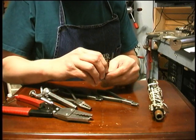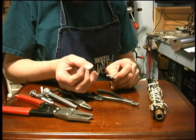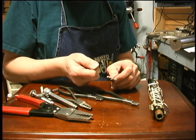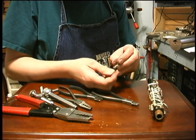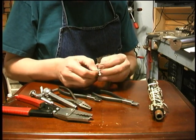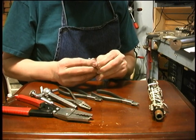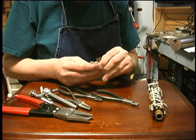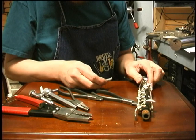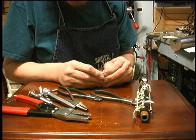The first thing that happens when you swedge is the hinge tubing will go down to the size of the rod. And beyond that point, the metal has to go somewhere as you continue to squeeze, so the tubing will stretch out lengthwise and fit more snugly between the posts. So I would work with that, and you can use the lapping compound if you over swedge, and that way you can get it fit better between the posts. If you do get it stretched too long, there are some tools you can use to shorten it.